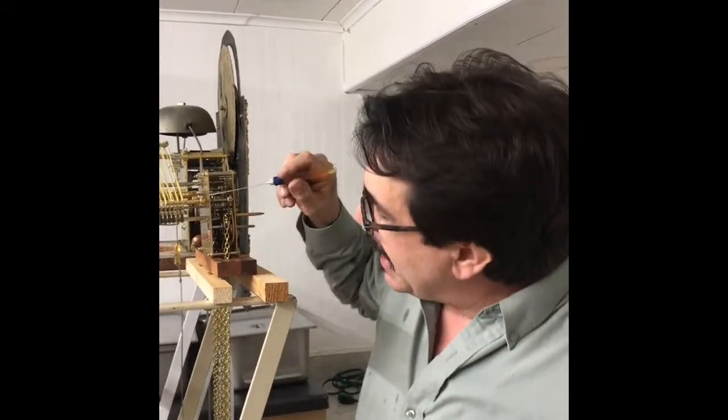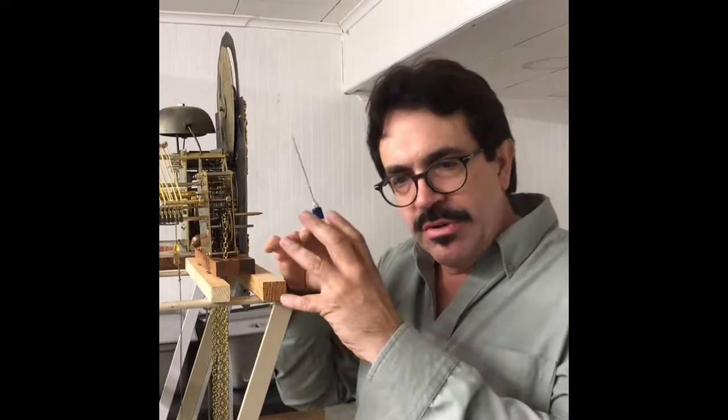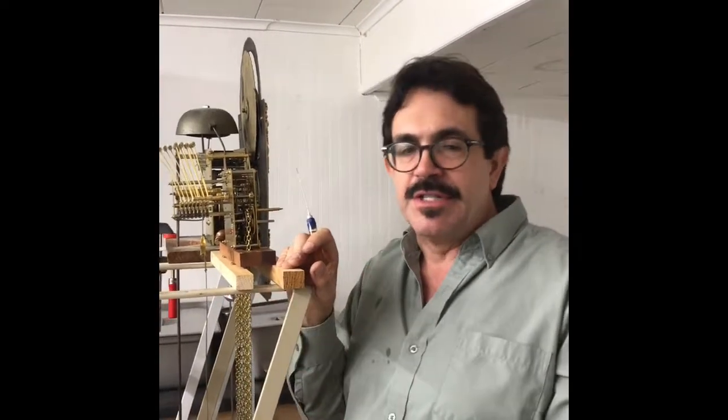It's really a grinding paste, and the hole has very tight tolerances where this axle goes through the plate. With a grinding paste, you're going to increase the size of the hole, and you're going to decrease the efficiency of your clock mover to the point that it will not run. So again, therefore we recommend that you oil only every 5 or 6 years and service every 10 or 12 years.